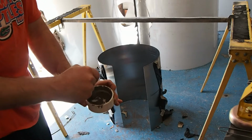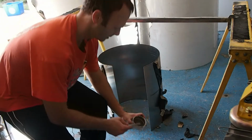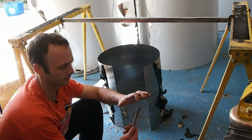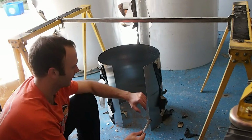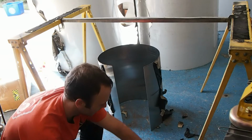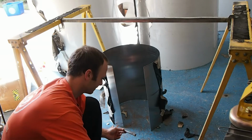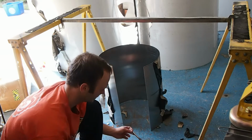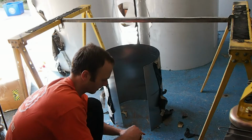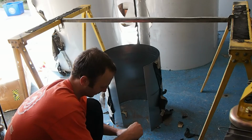So go ahead and just scrape it, and then I get my ethanol. See, this is just a stainless steel acid brush, and I trimmed the bristles so that they were flat and stiff, so that when I apply it, I don't need to waste a lot of flux. So these brushes are cheap. You buy these for soldering or whatever over at Lowe's. You just add some ethanol, or you can add isopropyl alcohol. They say the best is methanol, but this works fine.